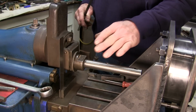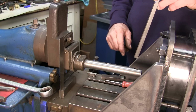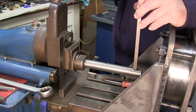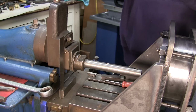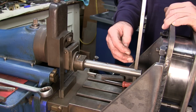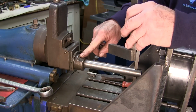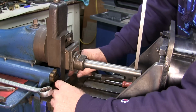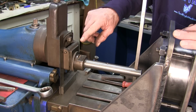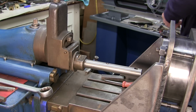Okay, we put our bar back in here. We tightened this in the vise in the other room. What we did is we put the clapper box in the vise of the mill, and we took a piece of nice 3/8 cold roll. We put it down in, was it this end we put down in there? Maybe it was this end. That was it. Okay, we put this down in and came off the side with a square to the table and aligned this straight up and down and tightened our nut. Well, now what we're doing is we're putting the square in here and we're just checking our clapper box that it's square. And we loosened this up, we slid our clapper box square. So now we know the tool bit is gonna be square when we put the bit in. All right, so that part of setting up the bit is all done.